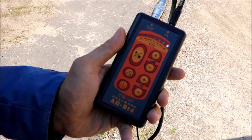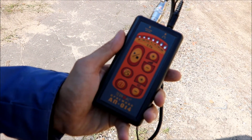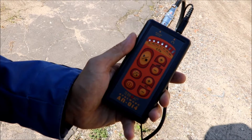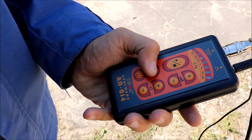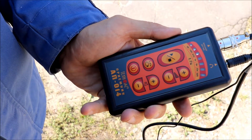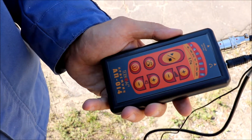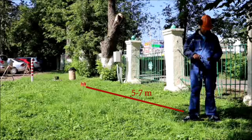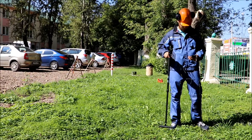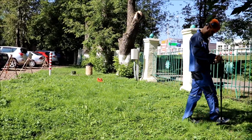Press the on/off button on the receiver and wait five seconds while the welcome animation finishes. To start location, set the frequency in accordance with your transmitter — the frequency is switched with the mode select button, and the diodes will light accordingly on the face panel. Take the receiver and EMD sensor and move away from the transmitter at a five to seven meter distance. Then slowly move in the direction of the utility, swinging the EMD sensor from side to side while monitoring the signal at the receiver panel.